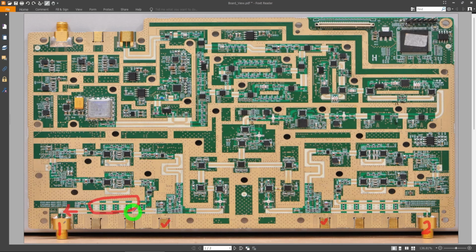So we have two couplers, and again you can see that they are identical on the left and the right side. These resistors are the coupling parts. So these two paths all need to be simultaneously stimulated and digitized and all that. We'll talk about this. So let's see where the stimulus signal of these ports actually comes from. We can trace this back. If I go ahead and trace it back this way, you can see that it comes this way, and then we have this symmetry here and here, so signal flows in both of these directions, and then it reaches over here in the middle, where you have a switch.